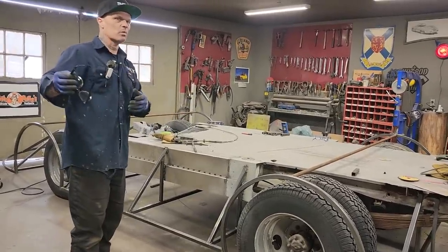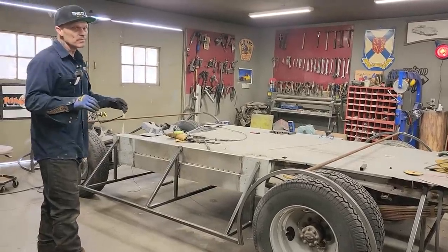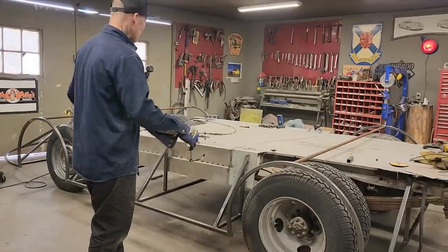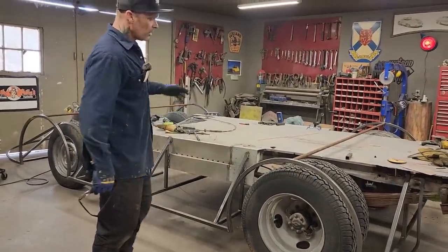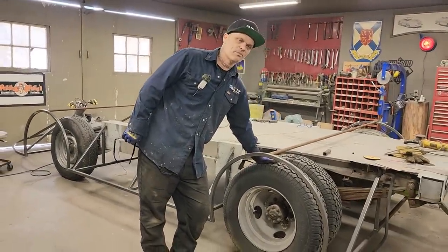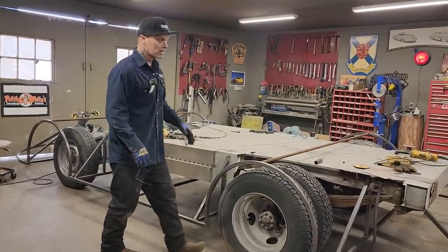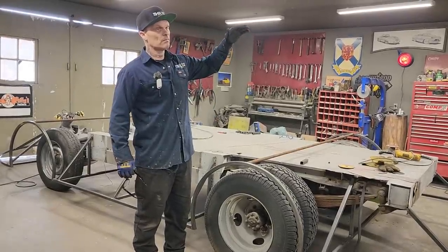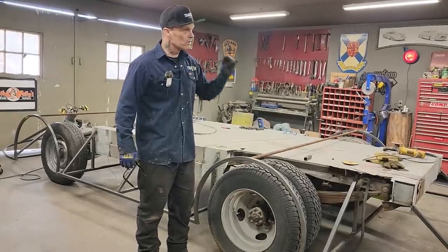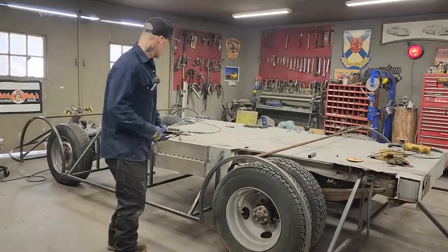We're trying to keep in perspective what's going on and why that vehicle is so attractive. To me, the vehicle is so attractive because of the height of it, the width of it, and the windows of it. So in order to keep this one on the same path, this wheel here is 29 inches. I'm just going to round it off and call it 30 inches. So in order to make this project, I would want to make it 60 inches tall, because the Texaco truck itself, they're saying, is 6 feet. The wheel is half of what the truck is. So if I went half of what this wheel is, I'm going to be 60 inches tall.